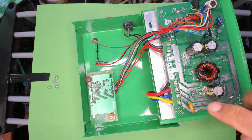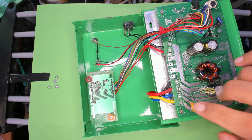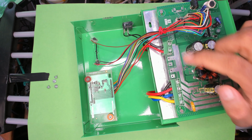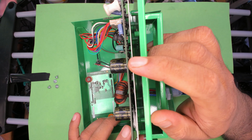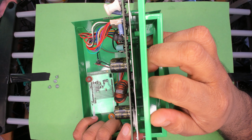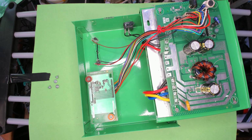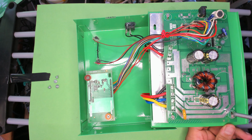Right, so what I need to do is get these off, and I need to remember what each of them are for, because the PCB silkscreen is hidden behind this, so I'll have to take them out and take a look. But at the back, I'm not going to take it off. You can see there's a bunch of MOSFETs that's driving the boost circuit, and the micro is like a PIC controller. And there's a TI chip that's a dedicated solar charge controller. So, you know what, I'll take it out and I'll show it to you. There's no point in half-assing this.